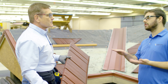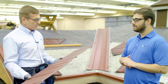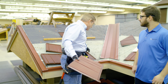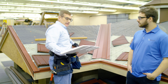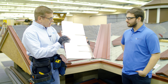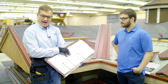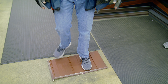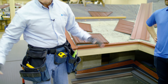What's the minimum slope these products can go on? This product can be installed all the way down to a 3/12 pitch. If you get to the point where the roof is no longer walkable, one option we offer that enhances walkability for the installers — and for anyone who might get up to service the roof later — are our foam backers. These are injection molded and conform to the back of the panel. I put this down on the cement floor and I can dance on it all day long and nothing happens to the shingle.